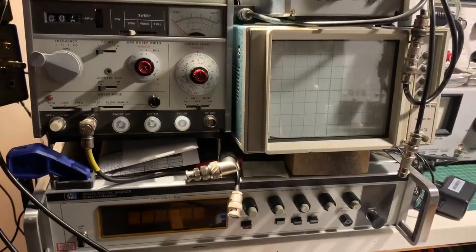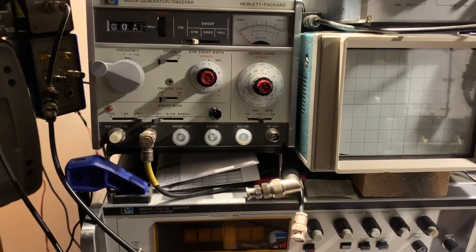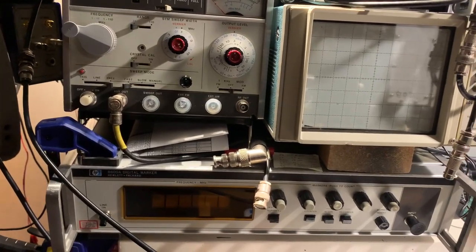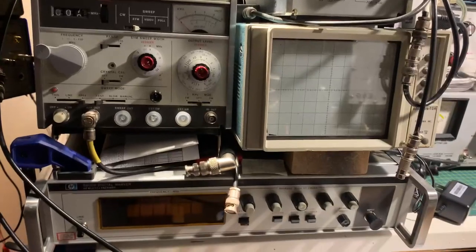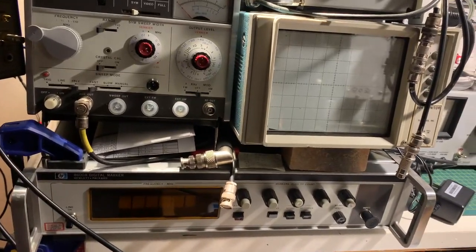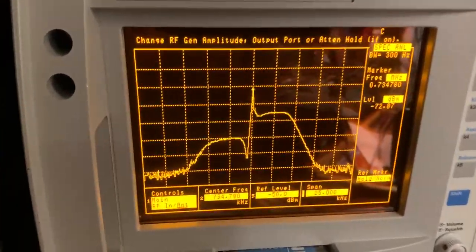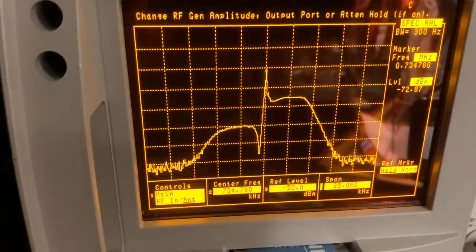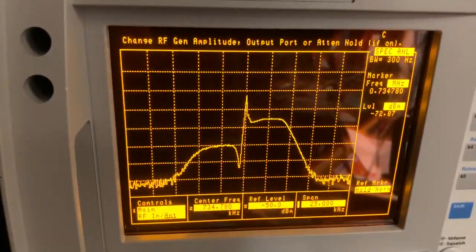It's kind of old, creaky, but the old HP 8601A, and its matching 8600A marker generator, and using it with a tech monitor. That actually will capture those curves. It's an analog setup. It will capture the peak of those crystal response curves, whereas at least this spectrum analyzer doesn't do that. It does a reasonable job, but it doesn't quite get there. So anyway, as I say, I'm thinking of investing in a better spectrum analyzer.